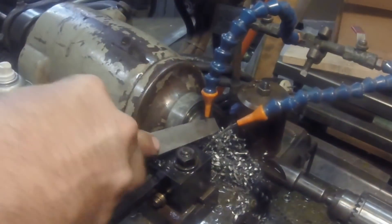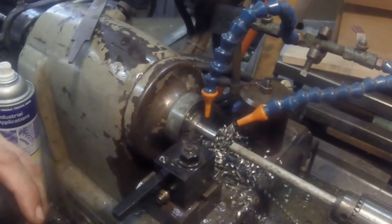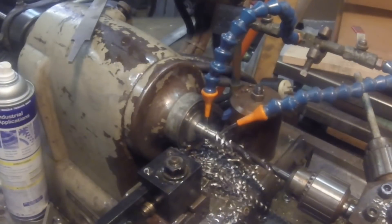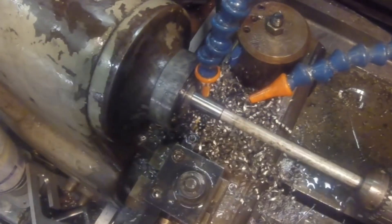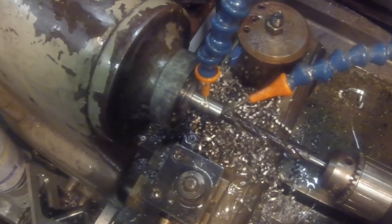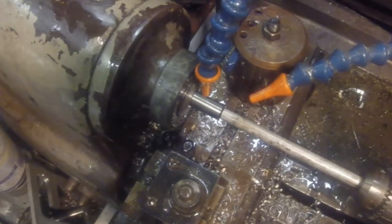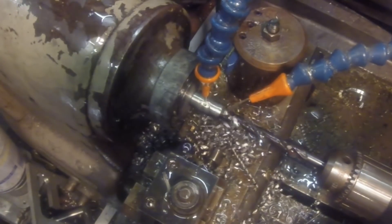Today's project starts off in the small turret lathe. Here I'm making what I'm going to call the feet or the rollers — these are the parts that actually come in contact with the part or with the table of whatever it's mounted to. So half-inch stainless steel: just setting it to length, drilling, parting, and filing the edges before I finish the part off.